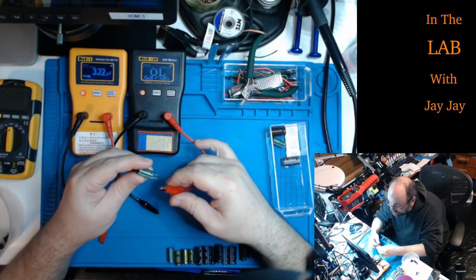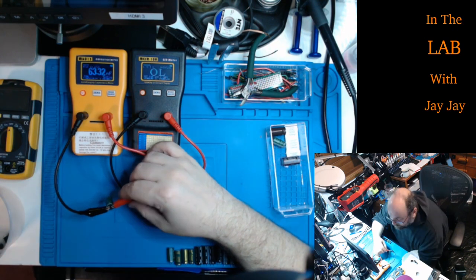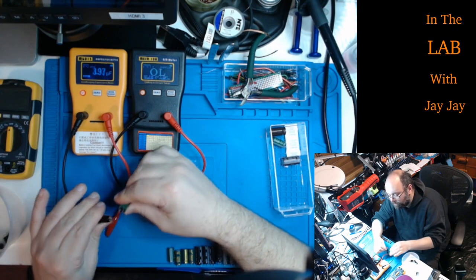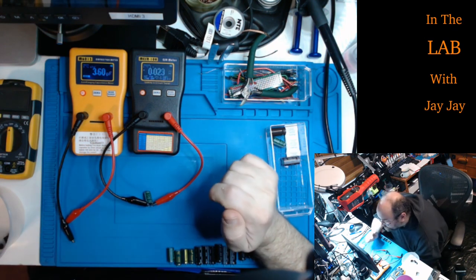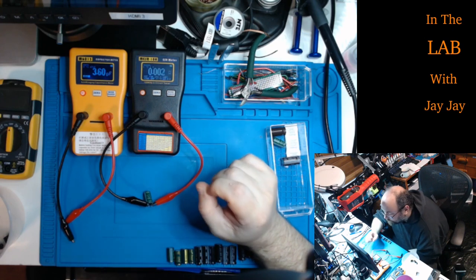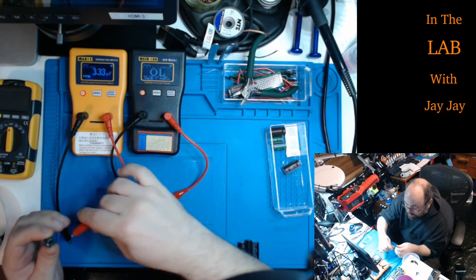And let's do the capacitance of this guy. And he's jumped up to 1600, that's what we want to see. And the ESR is small, very small. Of course, it goes up a bit as it heats up, but it's well within spec. That's good. And then we do this guy.